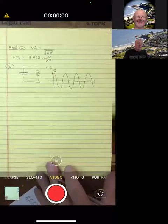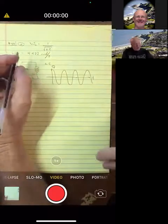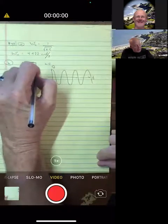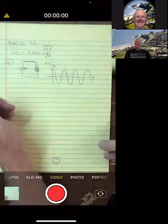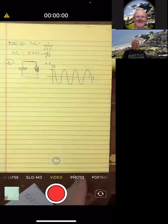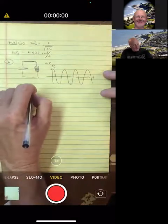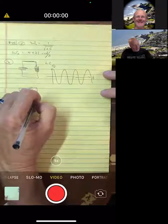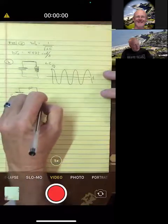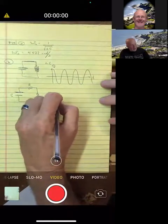There is no resistance. Now, of course, in a real circuit, you can't get away from resistance. You may not put a resistor in there, but just the wires themselves, and especially the small wires that wrap around, they're kind of long by the time they make up that inductor. There usually gets a significant amount of resistance in here. So what we like to say is a realistic circuit is an LCR circuit.